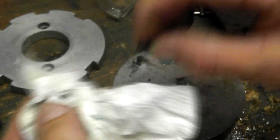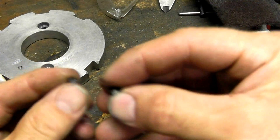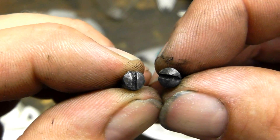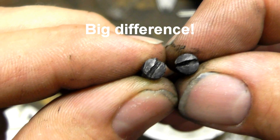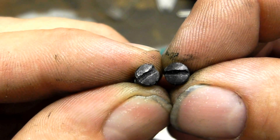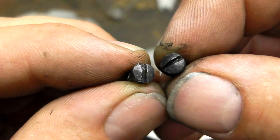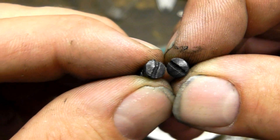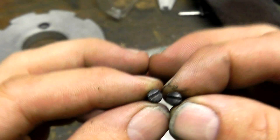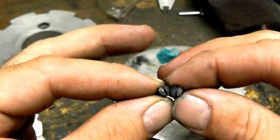Let's take a look at how these two screws came out. The one on the left was the worst - there's actually metal missing where apparently when they tried to remove that screw in the past, as it twisted out of the slot it took a chunk of metal with it. There's not a whole lot you can do about that situation. The one on the right came out perfect - you really can't tell we did anything to it at all. You can easily do this at home; you don't need any special tools, you just need to be able to get your screw out properly without destroying it. Use some WD-40 or oil first so you don't do the same thing the last guy did and make it look even worse.